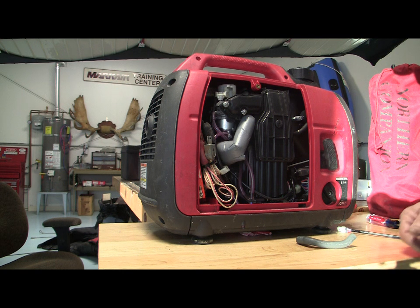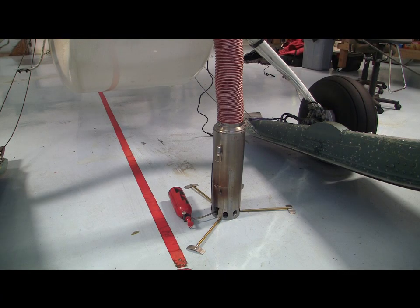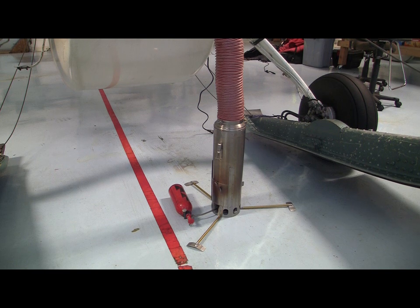Install the cover and you're good to go. To recap: my primary preheat system is an interior installed engineered preheat system — 500 watts — but you need 110-volt AC electrical power, either plugged in or via portable generator. I outlined the generator use and how to mitigate some of the problems. My primary outside preheat source is the Northern Companion.